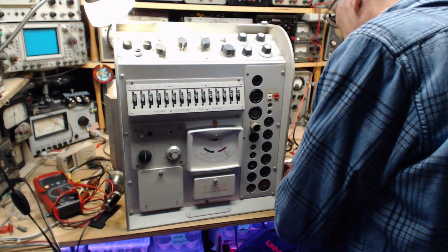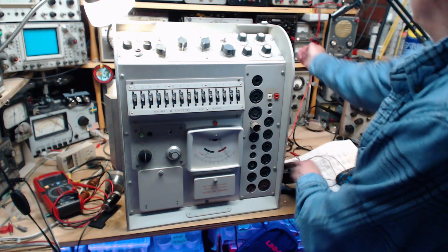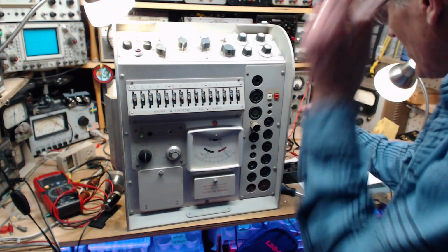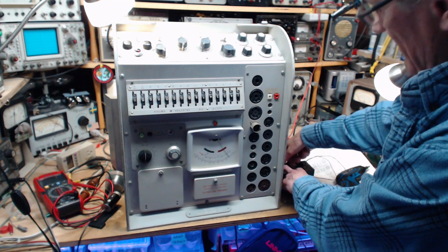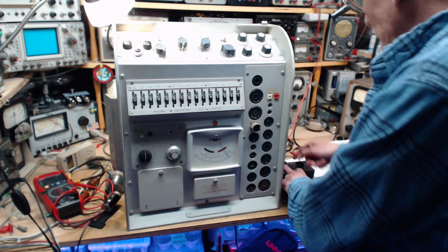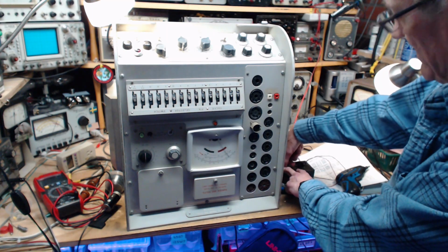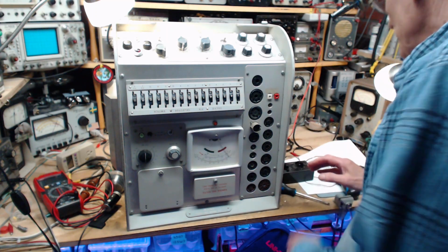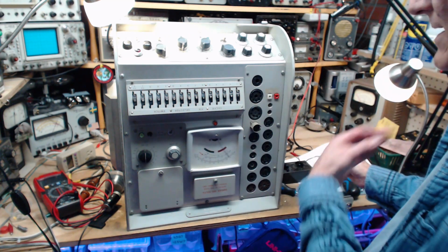Okay, so the resistance I've got in here is 100,000 ohms. 50,000 ohms. Flip the switch on and off. This looks like the meter is burned out. Going down, this would be 33K, 15K. Okay, now let's do this. We are now at 10,000 ohms, 6,000. There's no movement whatsoever. Now there's a chance maybe my connection's not good here. Suddenly the connection will make the meter move.